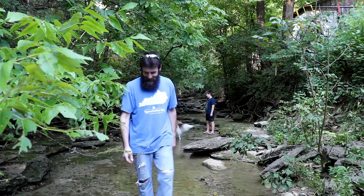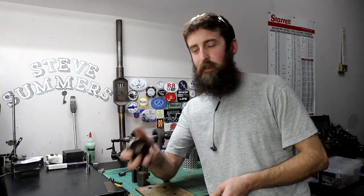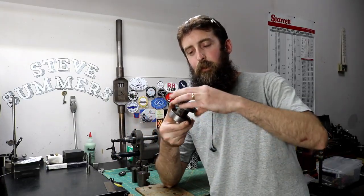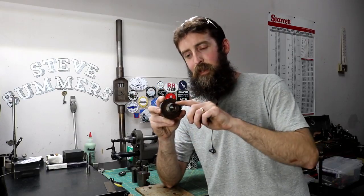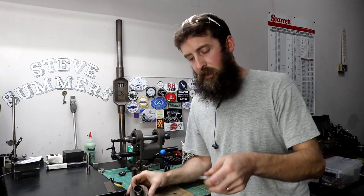This video is going to be a continuation of last week's video. We're going to try to finish up our hub that we've been making that holds our grinding wheels to our cutter grinder. There are still several steps before we're done — I need to cut my slots for my keyed washer onto the hub itself and I need to finish up or make the washer and the nut.